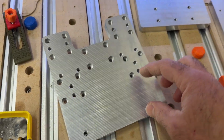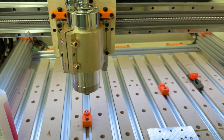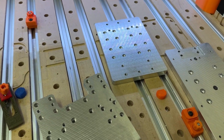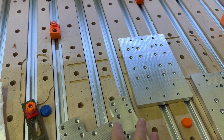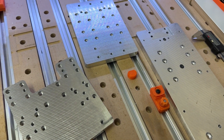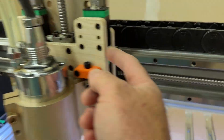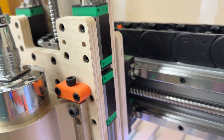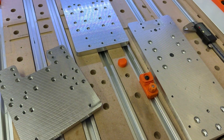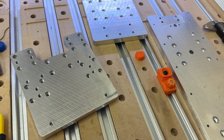The extended tram plate just allows the Z-axis to go a little bit lower, and it suits my setup a little bit better. These files are available, but feel free to use the PrintNC standard tram plate dual carriage version, which they have up on their site as well. Over the next little bit I'll probably put the camera on time lapse and I'll be taking apart the Z-axis and the X plate and hopefully replacing them with my parts.